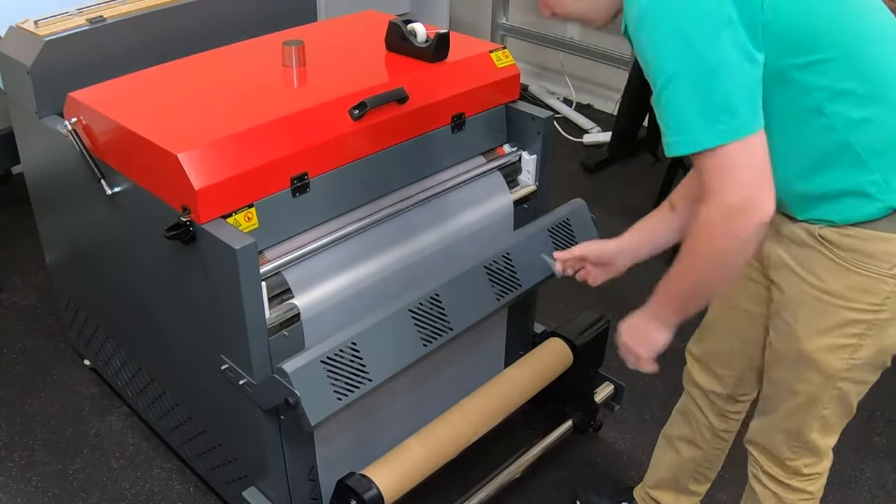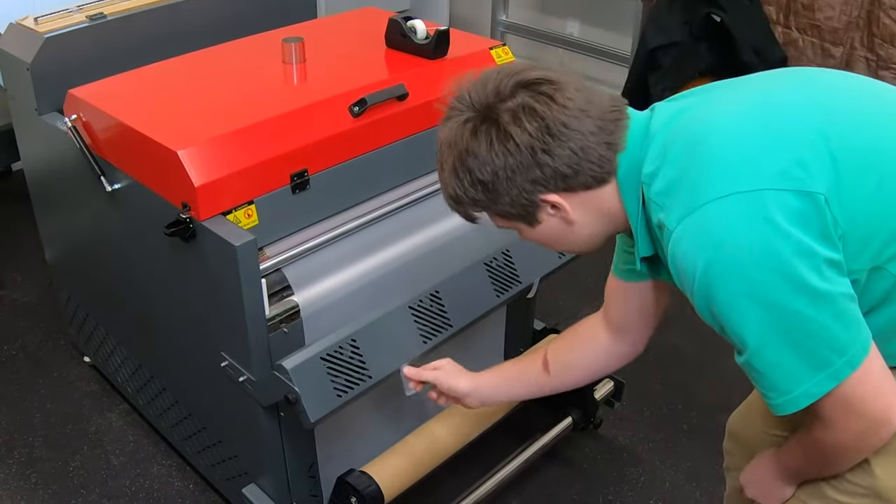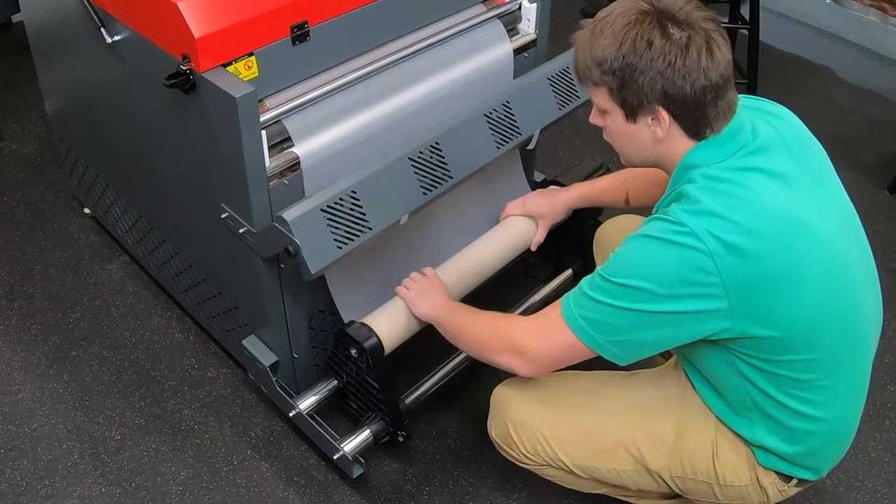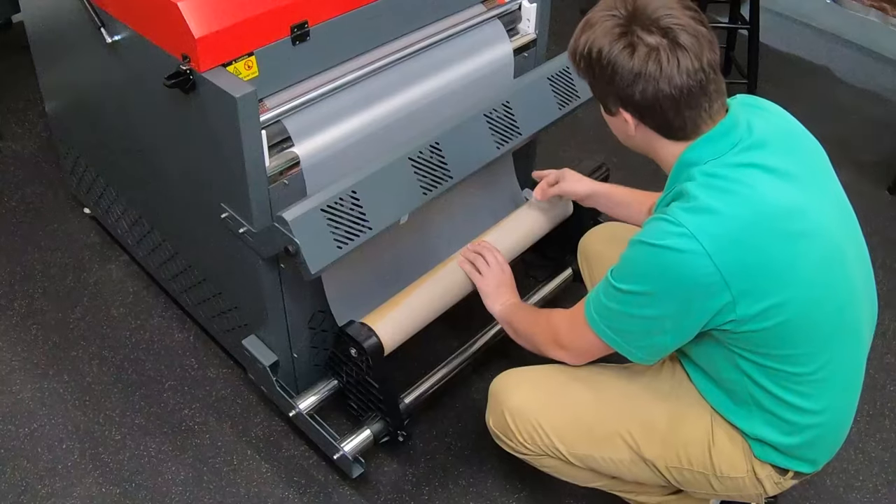Get a few pieces of scotch tape. Take film from behind the take-up roll, pull it underneath then up, and align it to the roll. Be sure it is parallel to the roll's edges, then secure it with the tape pieces.